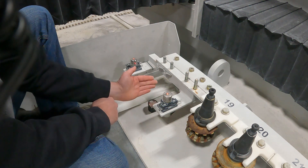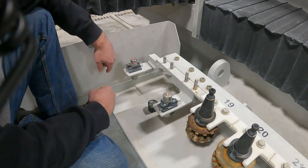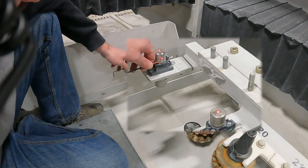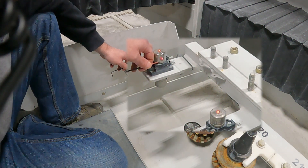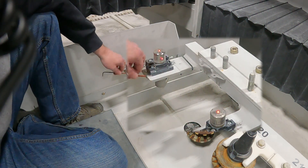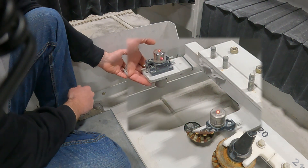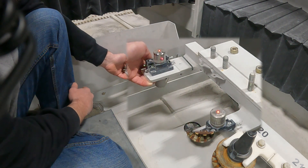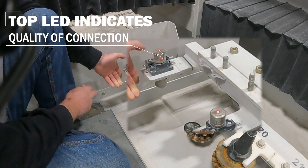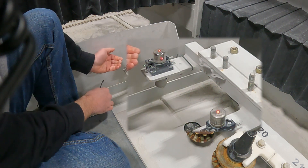To start out, we can see we do have a red beam coming out of our transmitter, so we know our transmitter is working. If we take a look at the red beam, I can see the hole that the beam needs to go into, and in our case the red dot looks a little bit high on that hole. That's how you can start to tell which direction you need to move. I'm going to do a quick check and lift up ever so slightly, and I can see my red light at the top turned amber — that means I'm getting closer to a good connection.